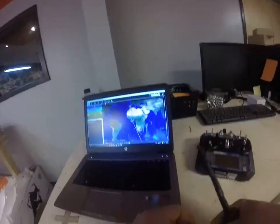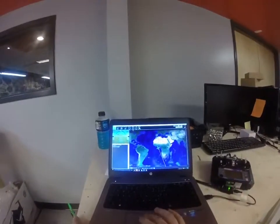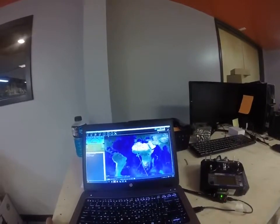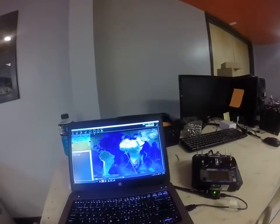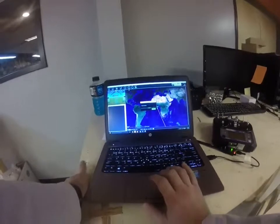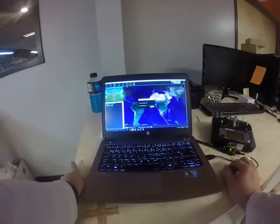The first step is to plug in your USB. In the upper right-hand corner right here, you'll see a COM area. Go ahead and click COM6 and we want this other pull-down bar to be 57600. We're going to go ahead and connect. It will be getting params. After this, your X-Plus-One will be connected.